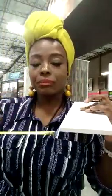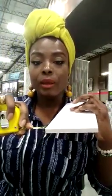Okay, so your installer can put a super, super tight grout line. You don't want your grout lines to look really wide. If you are using something like a pebble stone, or your installer has convinced you that you need a wide grout line, then I think the company Mapei carries an FA grout that's ideal for large gaps between tile. That particular grout sets quickly, so they've got to clean as they go along, right? This is just a little side note for you, the homeowner, so you can be as knowledgeable as possible.